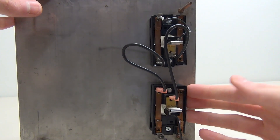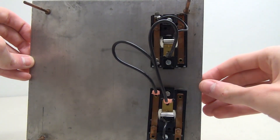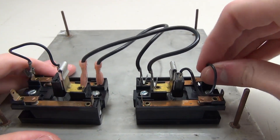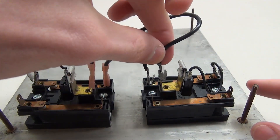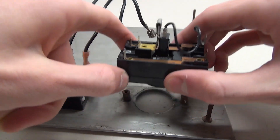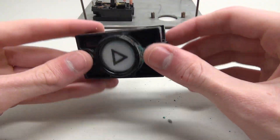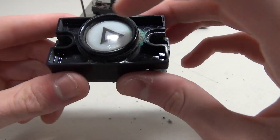Let's turn it around and look at the back. The backs of the Dover traditional buttons are quite simple — not a whole lot to them. I'm going to pull one off and break it down. Something I like about these Dover fixtures is you have these neat little wires with clips on them. You just pull on them and they come out. Each clip has a spot to connect to another piece, with a little bit that hangs off so you can add more — it makes it super easy to wire. Once you remove the screws you can pull out the button. This is what the button mounts into: two little spots for screws and a standard hole. The button itself is quite small, compact, and very simple.